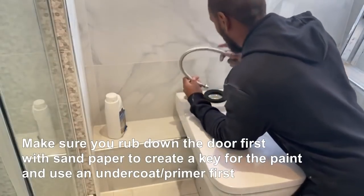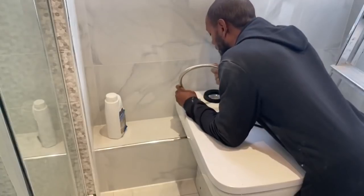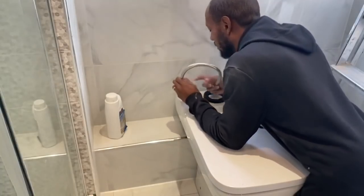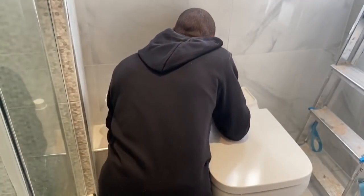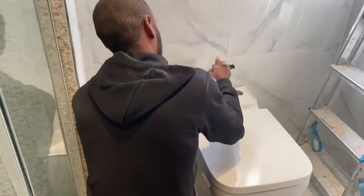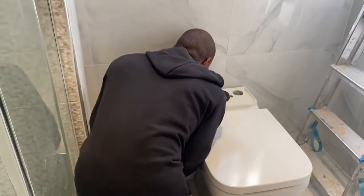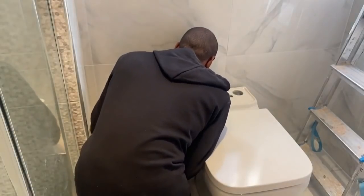And now we're just connecting a new water inlet to the toilet. It's on a flexi hose, braided flexi hose, which allows you a bit of flexibility and movement when you're installing toilets like this. Also, if you had to service the toilet and move it, pull it out for whatever reason, a bit of flexible hose is very helpful for that, and also makes it a lot easier installing it,